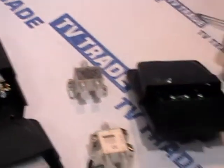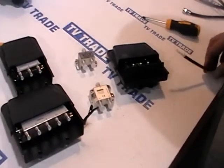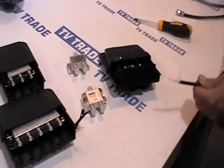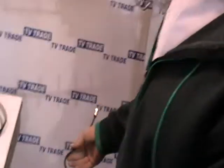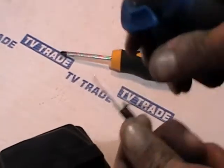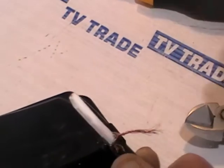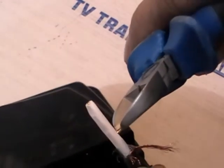So in a very simple situation this is a very good solution. I'm just going to quickly show you how we would split this. We are going to imagine that this cable is running directly from the aerial, and the end of the cable has been pared down. I have a set of snips here. I have already pared down the outside of the cable and the copper outer earth wiring has been wrapped into a single tight ball or length like this.